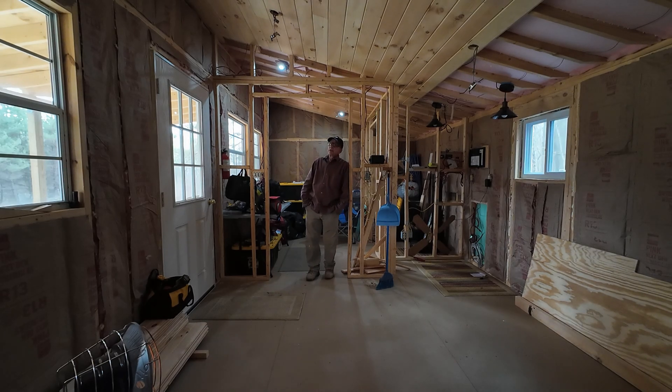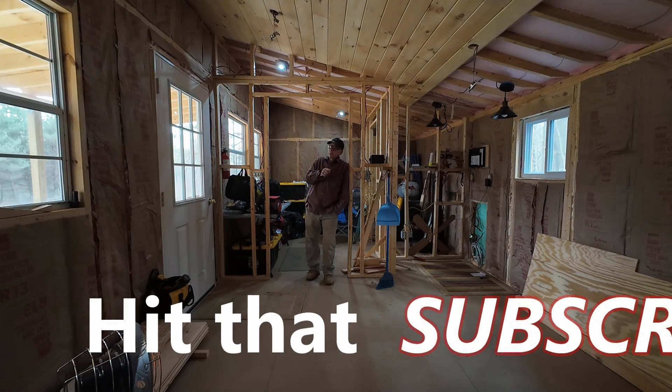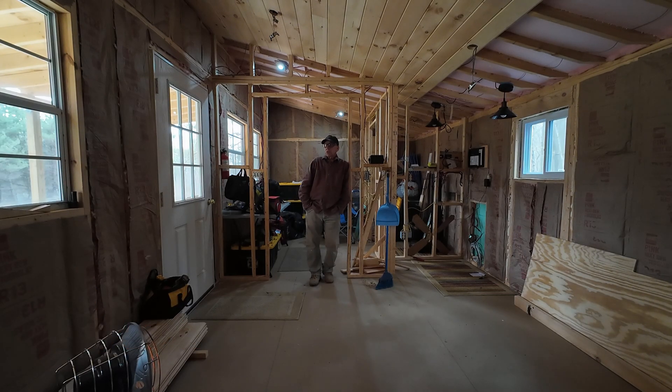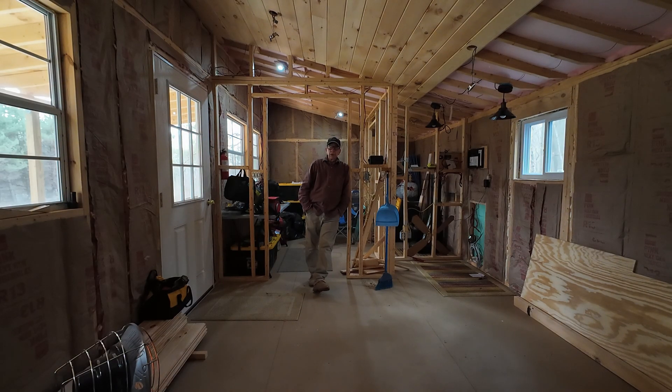If I could change anything, I probably would have bought a 2000 watt inverter instead of a 3000 watt — that's overkill. It's nice in that I can use power equipment up here, but I just do not have enough battery capacity to even utilize that in the long term. A 2000 watt would have still given me that startup surge of around 15 amps.